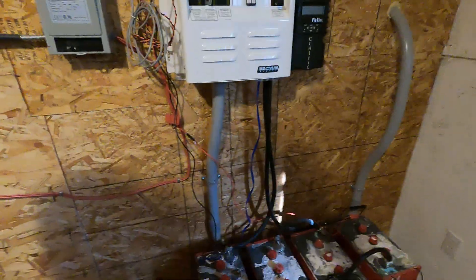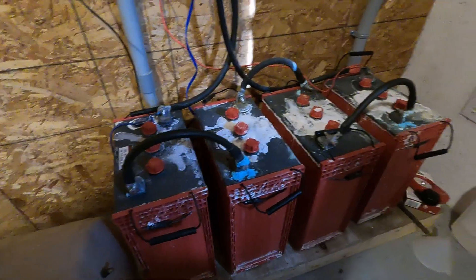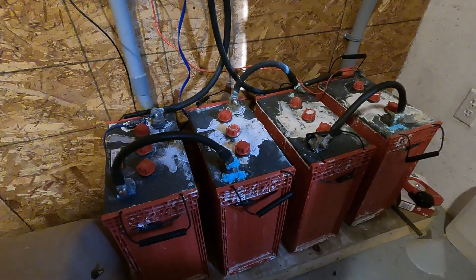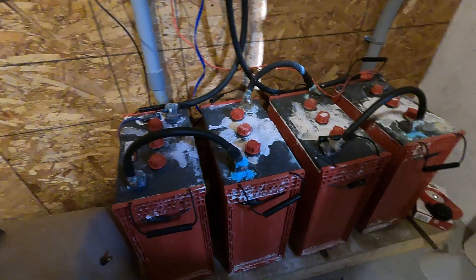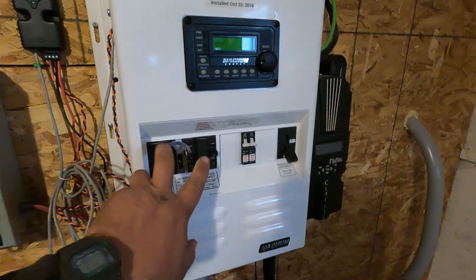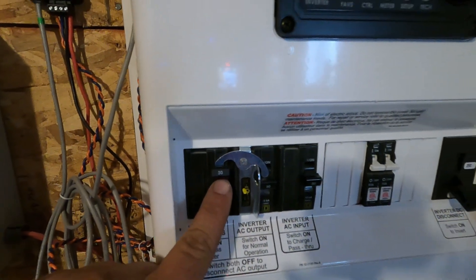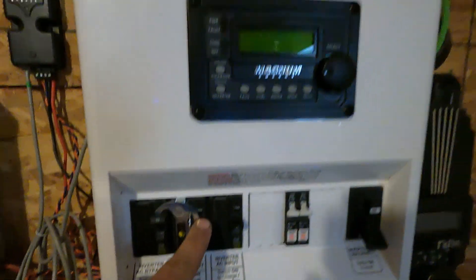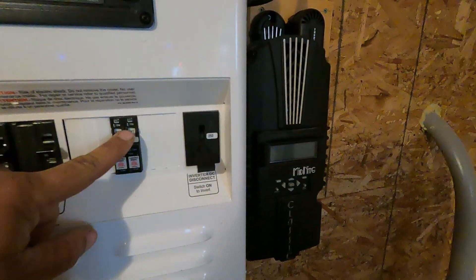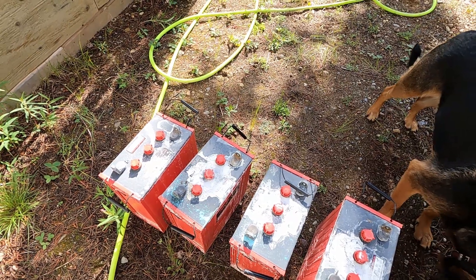We're down in the battery room and you can see I've got some corrosion on here, so we're going to take them all out and clean them up today. We're going to try the hot water versus baking soda methods. On my inverter setup I've flipped these breakers here, which allows me to run fully off the generator so I can keep some lights on while having the inverter off, the solar charge controller off, and any power from here to the breakers turned off.